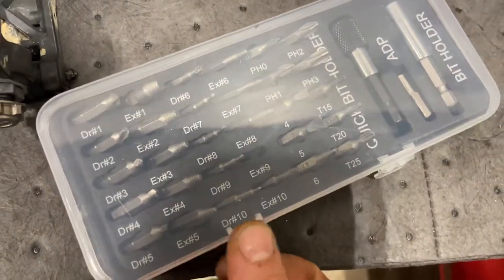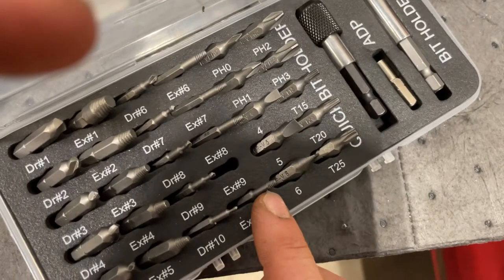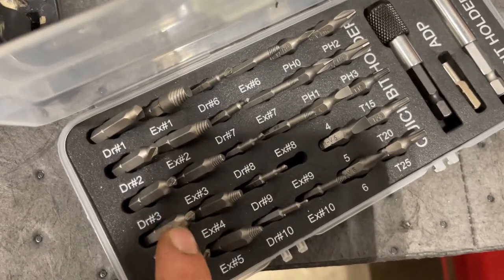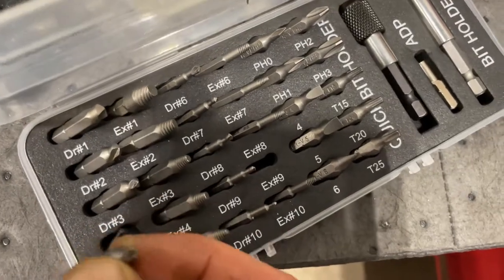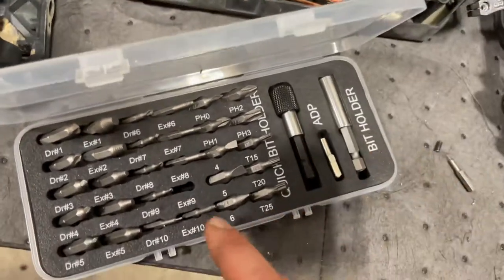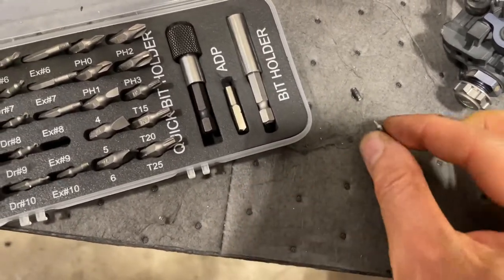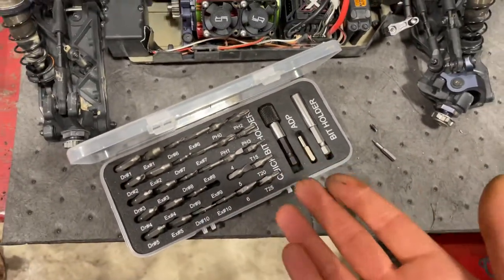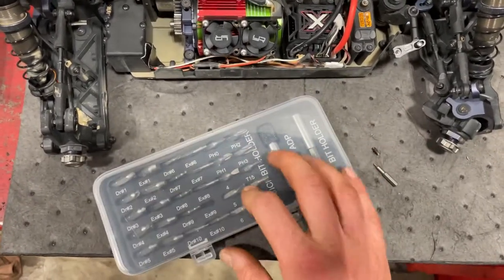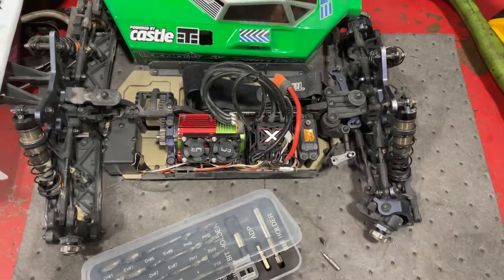You're definitely going to need an extractor kit like this. It does lots of sizes — that's one of the smallest ones in here, and they go all the way up to pretty big sizes. These little bits come with a little drill end on them, but basically garbage, which is why I had to bring it into work where I had all my drill bits. I mostly bought this just for the extractors themselves. I think it was like $13 on Amazon, and it definitely paid itself off right here — even if I only ever needed it for just that one screw.